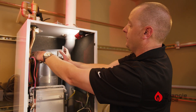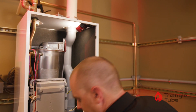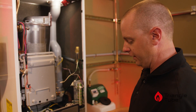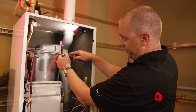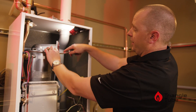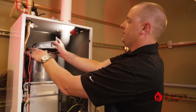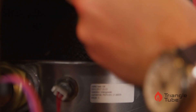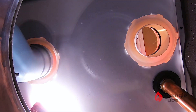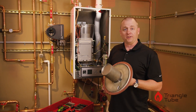The burner is now ready to be removed. The rubber gasket does create a bit of suction, so you will need to use a flathead screwdriver to break this suction. Ideally, pop it right below the connection for the fan. It doesn't take a lot of force. Once that's popped loose, you can now lift the unit up as an assembly, making sure that the gasket and insulation block are attached. Once we have removed the burner plate, we can now inspect the burner for any debris or damage.